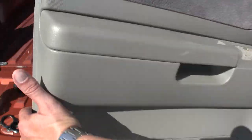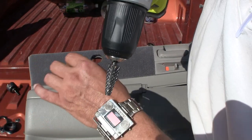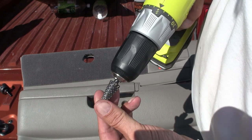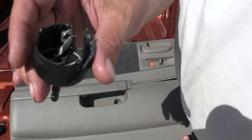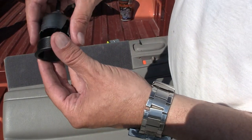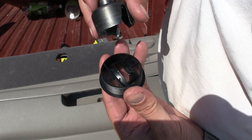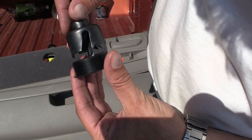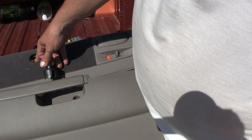Next thing I'm going to do is take this bit here — this one I had that works — and run it around the inside of the hole. The hole is a one and three-quarter inch diameter hole saw, standard size, but this right here is a fraction bigger than one and three-quarter, like one and seven-eighths or so. What we're going to do is grind out the size of the hole, because you can make a small hole bigger but you can't make a big hole smaller.